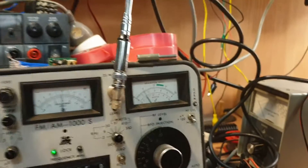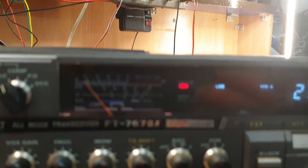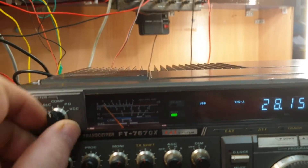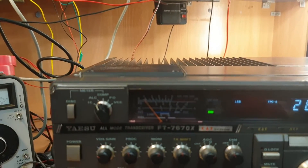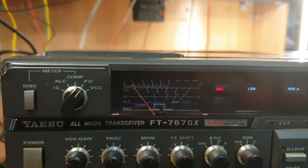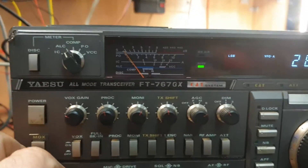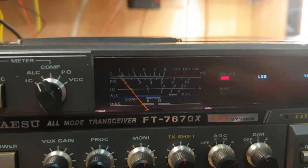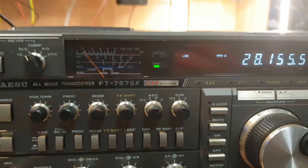It's interesting — we're getting really good meter movement on the lower bands, but we're getting absolutely no meter movement on ALC, which normally is an ALC issue. Because I'm on ALC it should show. I've seen a few Yaesus do this, to be honest. Normally it's a matter of tricking it a little bit, but there's still no ALC there. That's one we'll put on the list to have a little look at and see why.